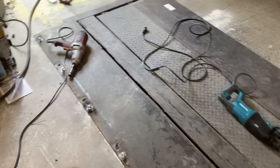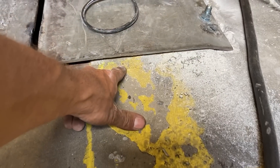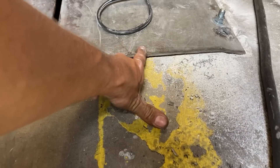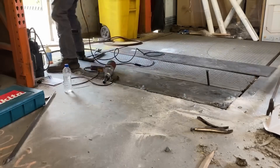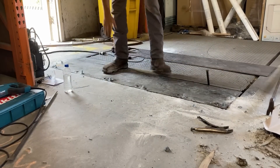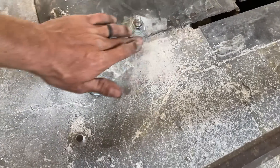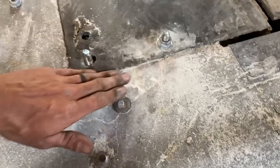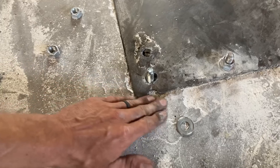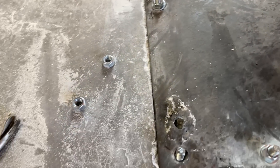So here's what we got so far — we have our redheads all in, they're all tightened. But the problem now is this side is lifted; it's like whatever was going on transferred from that side to this side. So I'm going to drill through this and through the concrete — we're going to slam a redhead in here just trying to get it flushed. I used the mag drill on this section so as not to pop the concrete with the torch. Everything's looking flush right here — we have a little bit of a lip still, but that's just because it's metal sitting on top of concrete. I'm going to go back with the grinder when I'm done and flush this out so it has a little bit of a ramp. Then we're going to take a grinder to it, probably heat and beat it once I weld — beat it down into the hole — and go around, cut these one by one, and weld them down.